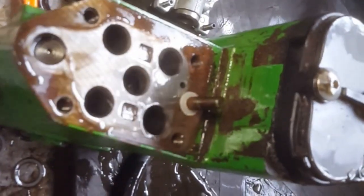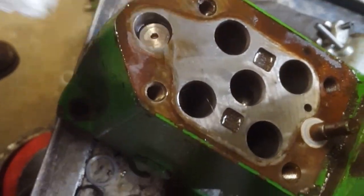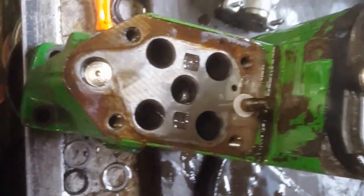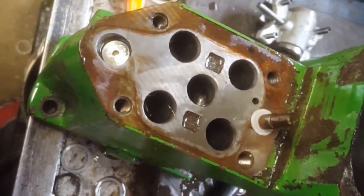That's this fun valve here, detent right here, that they got a stupid little internal snap ring, little piece of wire snap ring. So you got to take a screwdriver, push that down, and get that little piece of wire out. It's kind of a fun little wrestling match.